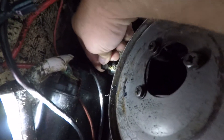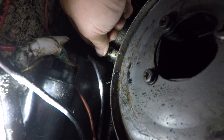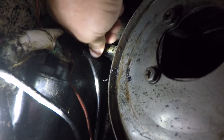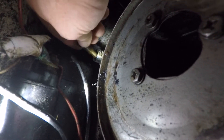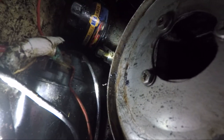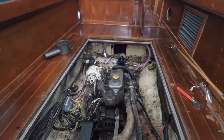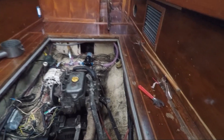To do that, you just open this nut up here — you can see a little residual drip. Open that up and it drains out of the block. You don't have to take this all the way out, but if you have any debris in there, you can open it up and get any excess out. Leave that open for a little bit and that should be the winterized engine. Again, this is the Yanmar 2QM15 engine, and that was the winterizing process for this year. It's the first time we've done it, so we'll see how it goes.